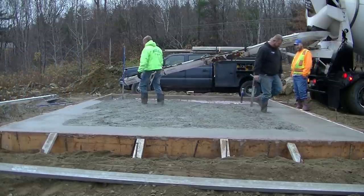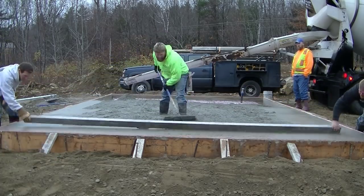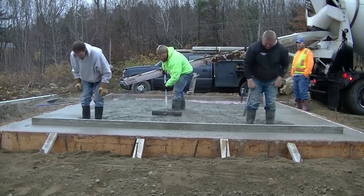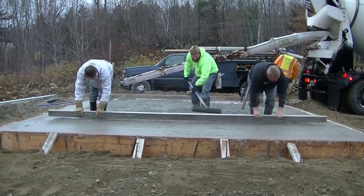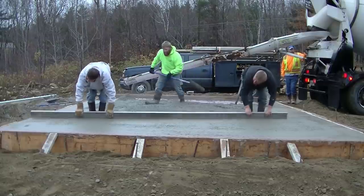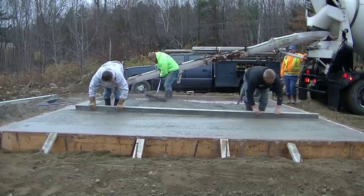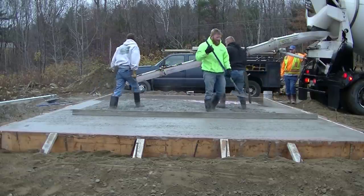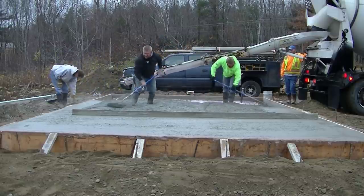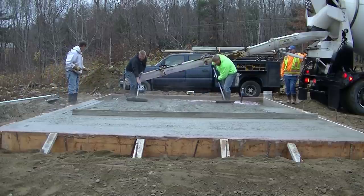We don't like to pour out all the concrete at once — for you guys that don't pour concrete much, there's no reason to pour the whole thing out and then end up too high and have to shovel it all out over the edge. The concrete driver will wait a little bit as long as you're not too slow. So just get most of it poured out, then screed it off. What we're doing is kick screeding — Luke goes a little bit, then slides it over to me, and I go a little bit, using that wet magged pad as our guide.